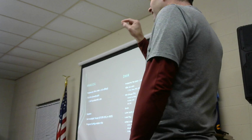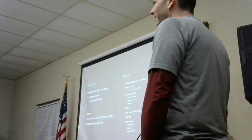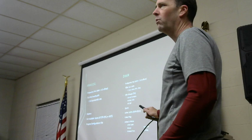It's like, I can't talk to anyone. Well, you need to put your DMR ID in. So 9999 is like the factory default, and it won't go anywhere on the network. You can use your local repeater all day long, but you won't talk to anyone on the network.